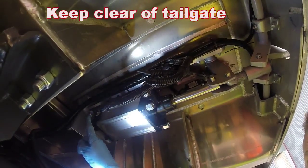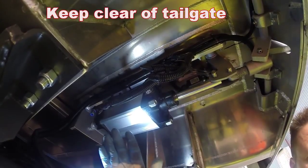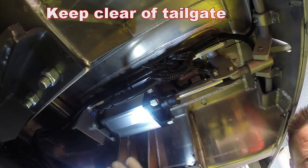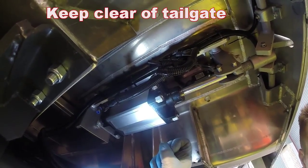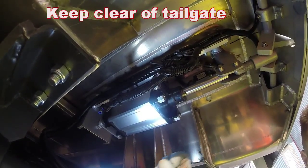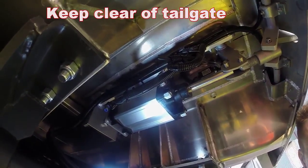We can now reconnect your 2 pipes front and back, build your air up on your vehicle and test it to see if it's any tighter. It's a process of elimination. It's best to do it 1 turn anti-clockwise, test it, another turn anti-clockwise, test it until you get the desired strength on the locking bar. So we'll test it now.